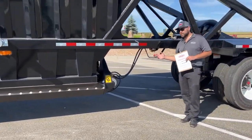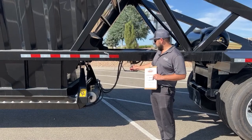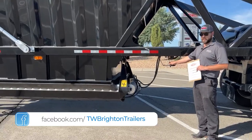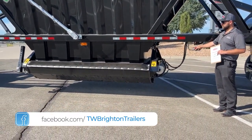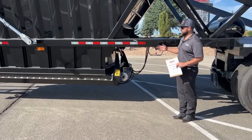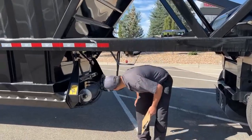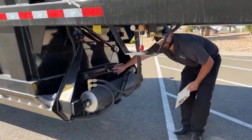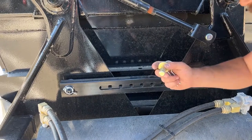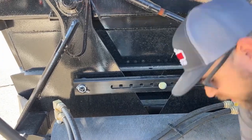If you're not running in-cab switches and want to get out of the cab for safety reasons or due to where you're running, this is the manual valve for the belly. As you can see, that didn't open all that big, and that's because there's another really cool feature on these belly dumps — it's this slide lock mechanism. Just got a cotter pin on the backside of this little brass pin, and you can slide that anywhere in here to control how wide that clamshell opens.